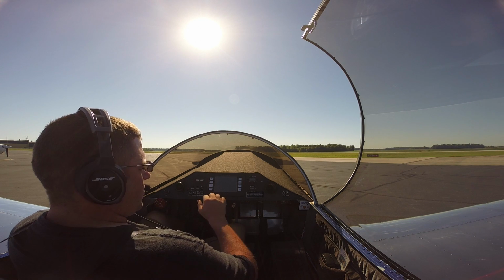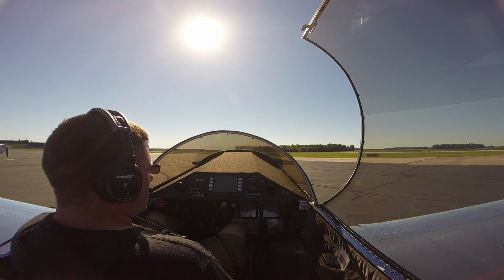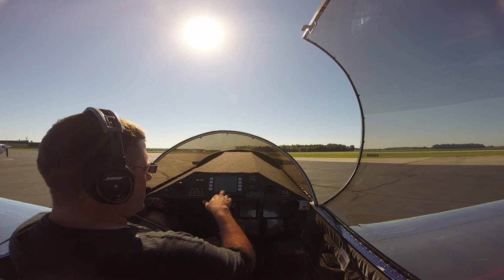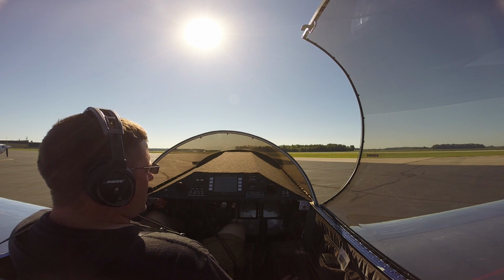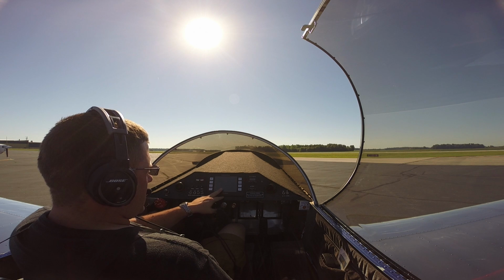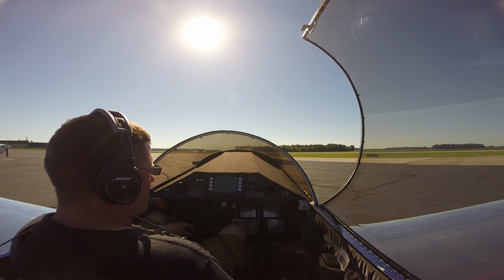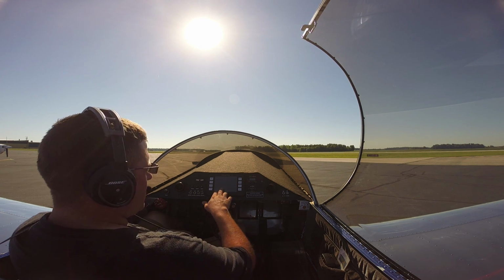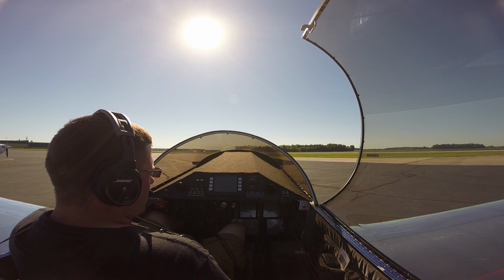As you are looking at the Turbo AeroV, a couple things you're going to see a little bit different. The primary new gauge you're going to see is a manifold pressure gauge. I have that located right here next to my RPM gauge, the tachometer, and right now, since the engine is shut down, it's indicating approximately ambient pressure, which is 29.4 inches, and that's what we should be seeing right now with everything shut down.